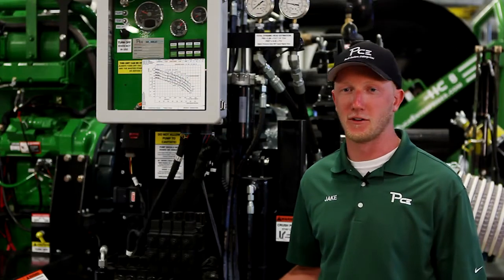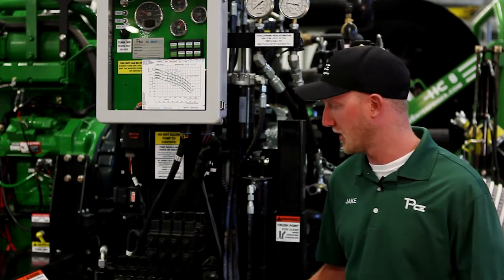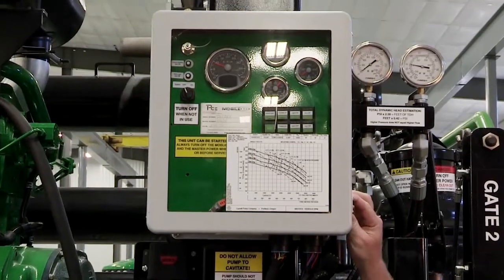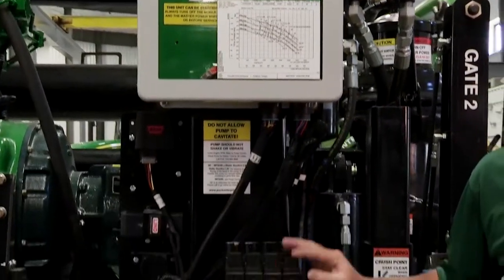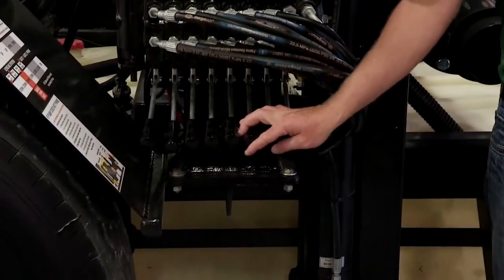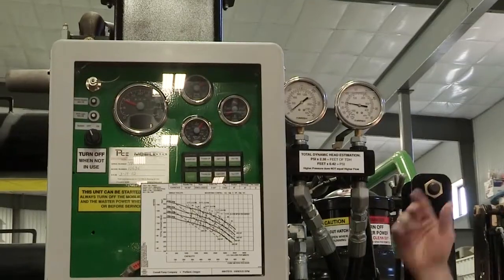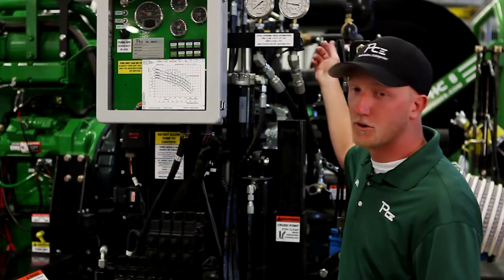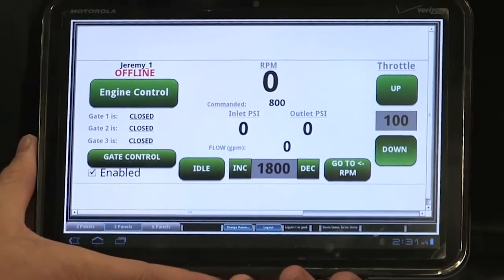Here we are looking at the towers on our lead pumps. This is kind of the brain of our lead pumps — we also have them on our boats. It's got everything on it. It starts with the MobileStar box, which runs the motors, the gates, and everything. Our hydraulic block runs all the gates hydraulically. You can also run them manually or through MobileStar via laptops in your tractors. It's got pressure gauges you can read by sight, and sensors on the back side you can monitor through your internet and MobileStar.